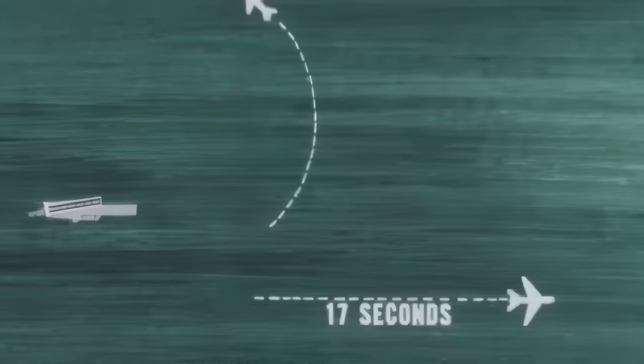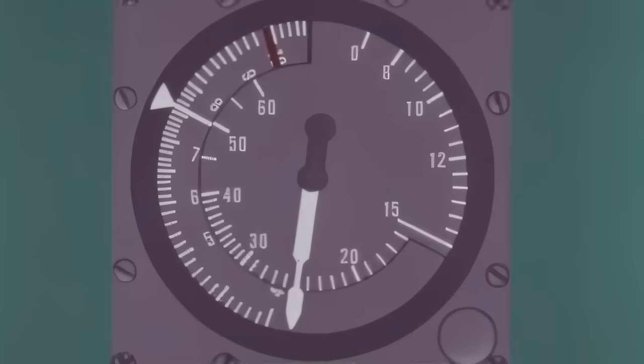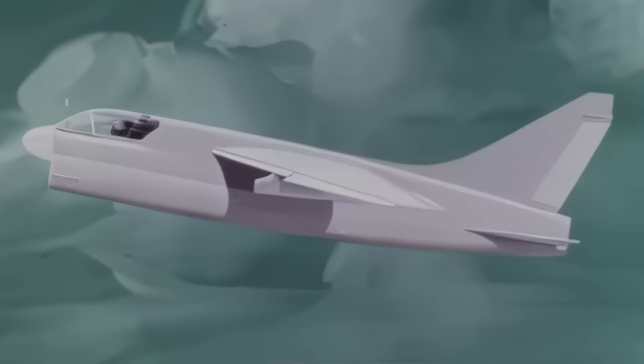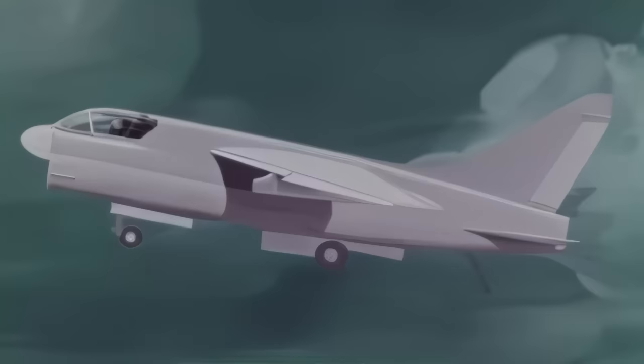Entering the break, 250 knots indicated airspeed is optimum if single, 300 knots for a section or more. After breaking, slow to 220 knots, dirty up and descend to the pattern altitude of 500 feet when wings level downwind.